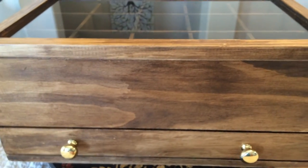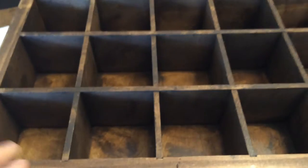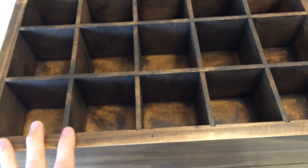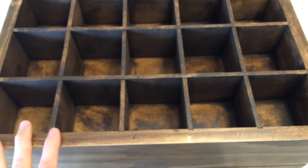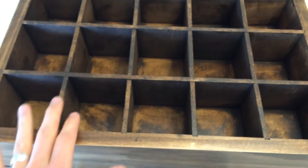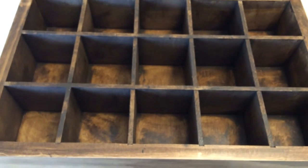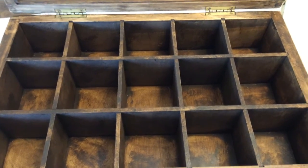Let me give you some ideas of what I did as far as the building on it. The little divider walls on the inside — this was quarter-inch poplar that I bought at my local home improvement store. Although I've since found a cheaper way: go buy two-by-fours. As long as the height works for your project, a two-by-four is great for it. If your saw is able to do it, you can mill out lots of quarter-inch wood from a two-by-four for a project like this.